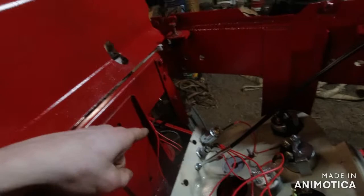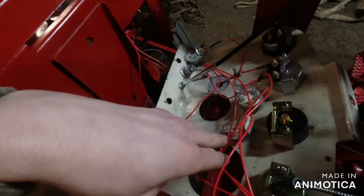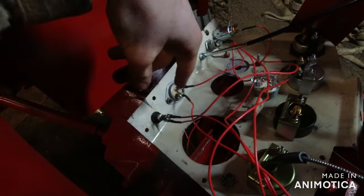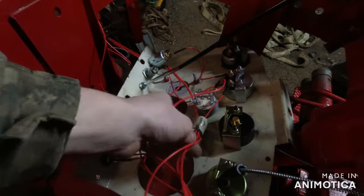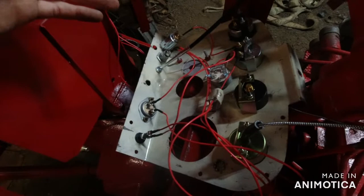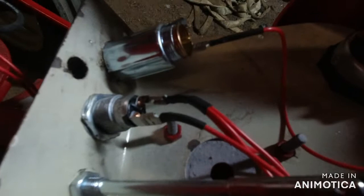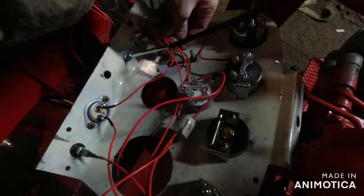I even got some more. I did end up wiring in that little black box. But I did everything, and I didn't fuse every single thing like I wanted to. I put it through one fuse down here, which is the dash fuse. So, that's alright. Oh, look at that. You can just tuck all the wires away in there. That's nice. But you can see, all this is hot wires so far. That's a lot of hot wires. But see, look at that key switch. You can't put more than one on because it's a little push one. I had to put three wires together. One to run the push switch, one to run the amp gauge, and then one to run the distributor.